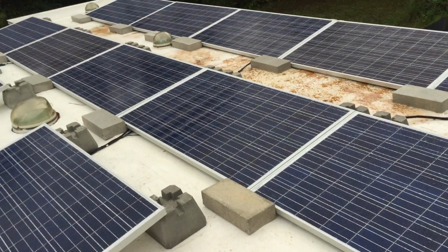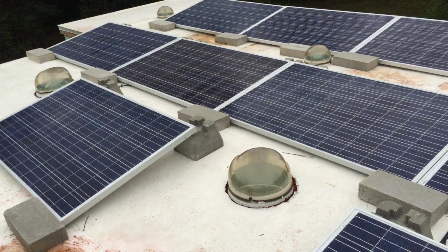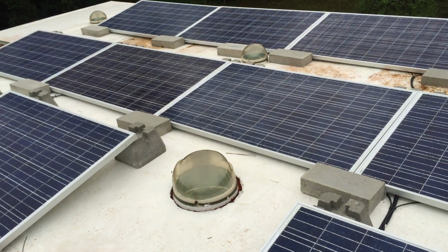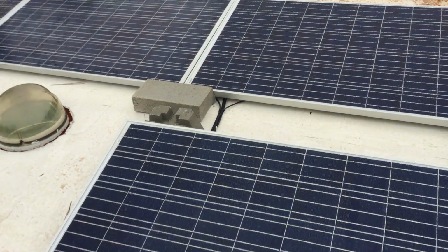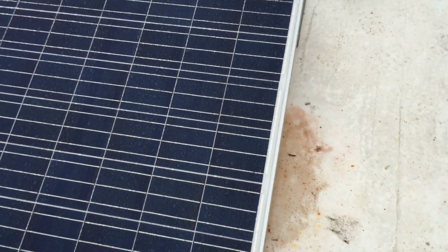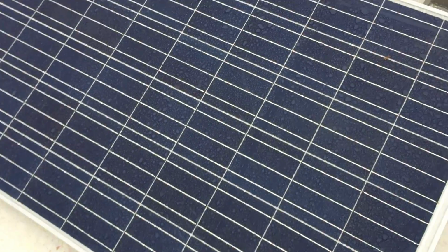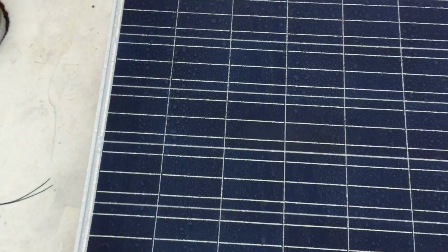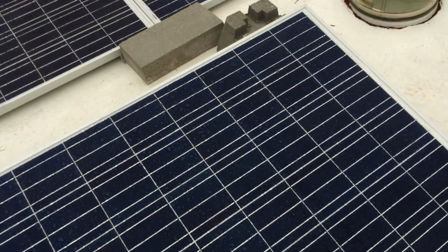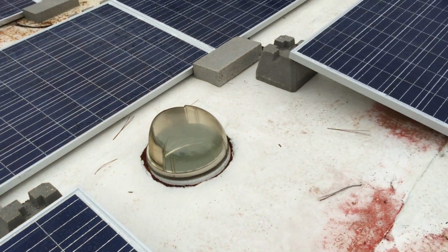We've got 3 kW on the roof, and they are in 3 groups of 4 panels, and that's coming off in the feeds, and right here is the drop into the house, and we've got all of this ballasted down. These panels are the new panels offered by Hurricane Wind Power, the Synthesis panels. They are 270 watt, which is what the customer purchased, and really nice quality equipment.